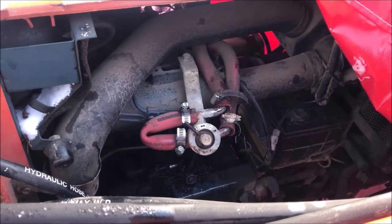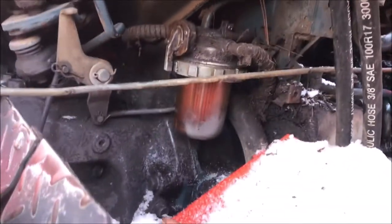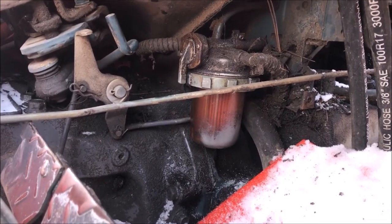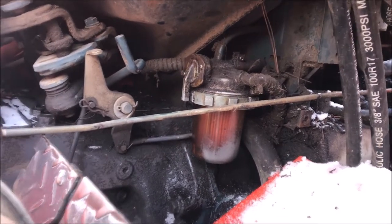The thing took off and ran just fine, confirming fuel flow was the issue. After seeing no fuel down here, I left the heat lamp on it for an hour and a half just in case something was frozen up again, but that didn't fix it. So now it's time to disassemble this bottom end and replace the lines and see where we go from there.